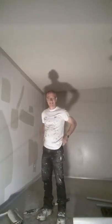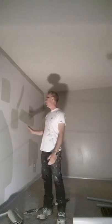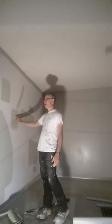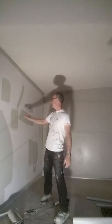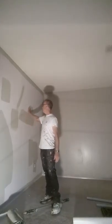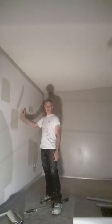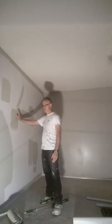Hi, I'm Terry and this is a little tip from Decor Painting. We've already talked about doing some wall prep — cleaning your walls, sanding them, and then spot priming. So now, as you can see, these areas are spot primed and they're dry. They've had some time to dry, and I just used the same paint that I'm painting with to do the spot priming.